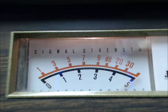Yeah, I like those radios. This one's real good. I just got to get the receive down on it. And I got one little capacitor that needs to come out of there, because when I get a real strong signal like an Eliminator being close to me, it hums in the receive. Smaller signals don't do it, but I think that's still that one bad can capacitor. It's definitely on its last legs. So I got to get that out of there.